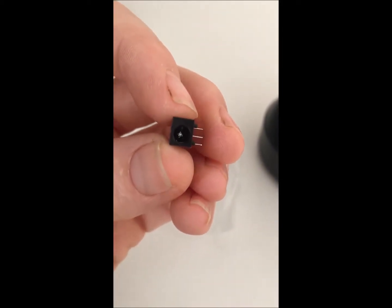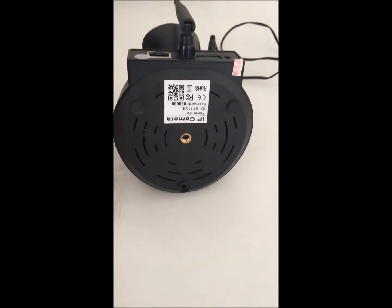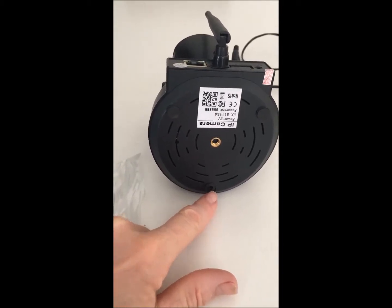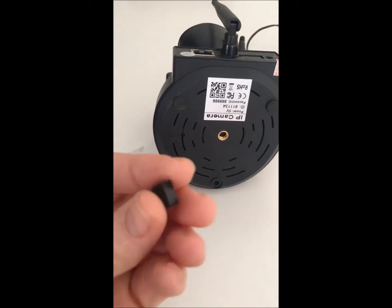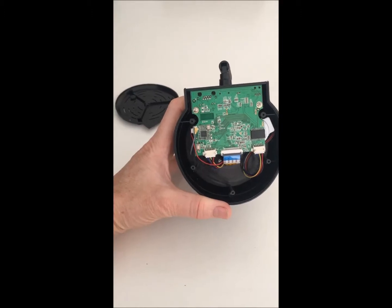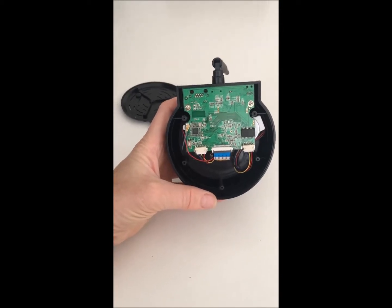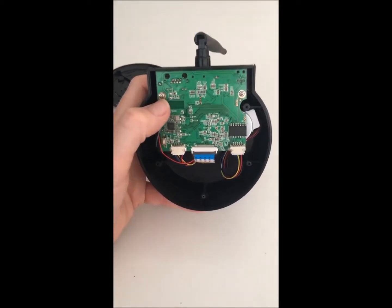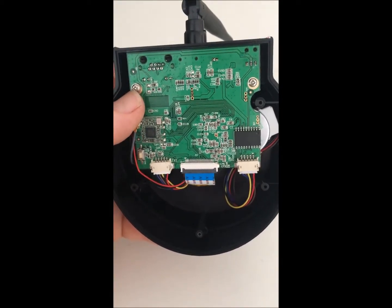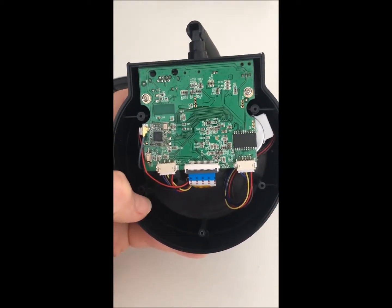There's the little metal bit that's missing. I'm going to take this apart — there are some screws in the bottom. If you pull off the rubber bits, the screws are in there, three of those. Once you've got the bottom off and undone the three screws, it just lifts off. There are also two screws — one here and one on the opposite side — that you'll need to unscrew to loosen the board, and there are some bits clipped in as well.